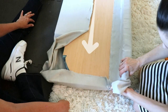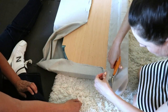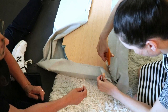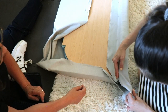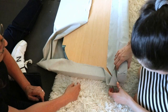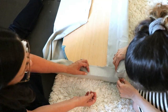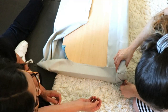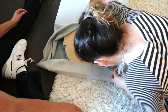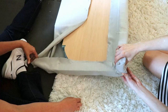I tacked the side pieces first and then had to work on the corners, which were really difficult just because it's contoured. I began cutting away some of the excess fabric piece by piece, trying to fold and tuck and see what it looked like. I'm sure my aunt Cheryl is going to laugh at me because she's been recovering furniture for years and I'm sure this is not the way it's supposed to be done — she could have done a way more fabulous job. But we did as best we could because we are certainly not professional upholsterers. I tried to tuck it under and stapled it pretty firmly to make sure it was in place and nothing would lift up. I ended up with maybe two tucks on that corner.